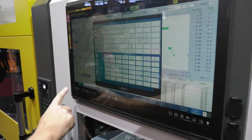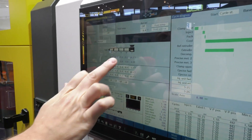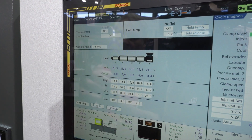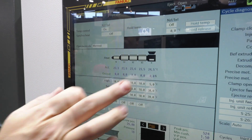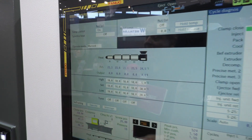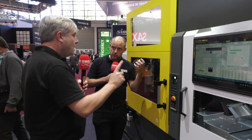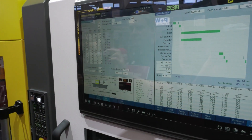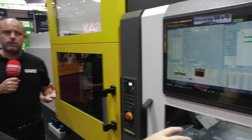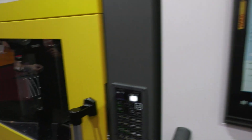On the touchscreen you can see the temperature settings. On a standard injection molding machine you'd normally start around 50–60 degrees to dry the pellets, then ramp up to 270–280 degrees. But here, because it comes in liquid form, you're keeping it around 24 degrees and actually heating it in the mold itself. So it's a reverse operation — instead of going from 50 up to 200 degrees, this goes from around 20 up to 165 degrees to set the resin in the mold.